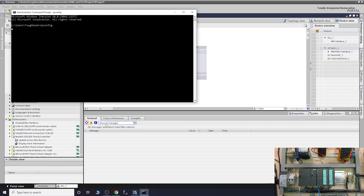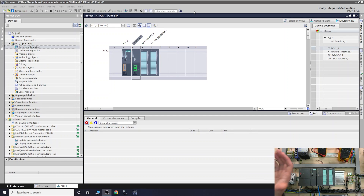If you run ipconfig, in my building I only have one network — it's 192.168.2.243. Ignore the other one because it's not connected to anything, it's just a default. This one is my Wi-Fi, my internal house network. I want to make sure that my PLC is within the same network. In some buildings, like my work, we had four or five different networks, so talk to IT about which network is best for your laptop and PLC.